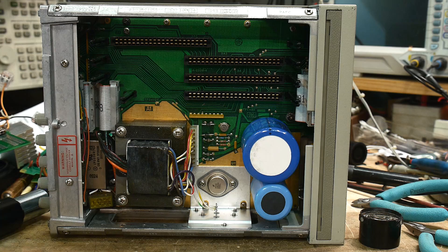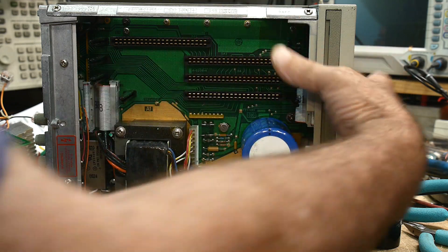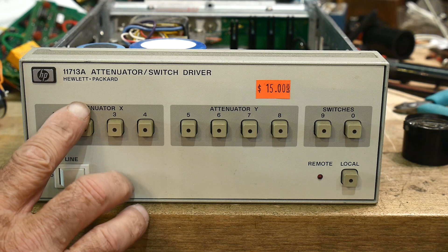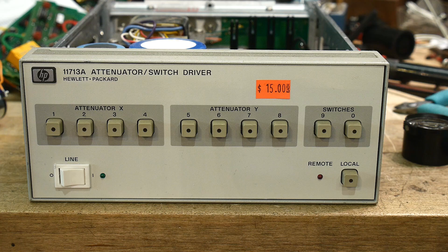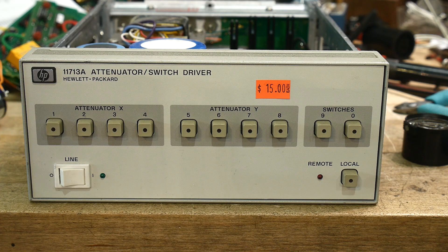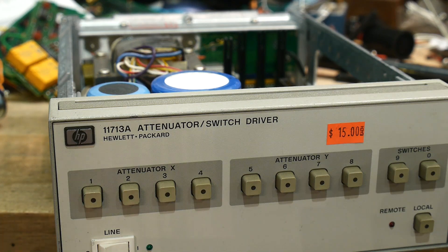I'll need to design a little circuit board for the top. I might actually lay one out — depends on how exciting I'm going to get. On the front there'll be a BNC input, a BNC output, and then some switches for variable gain. The amplifier will have a gain of 1, 10, and 100 or something like that. And maybe a meter? I don't know.